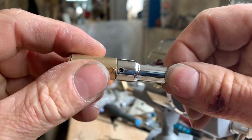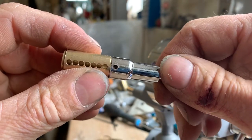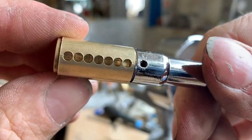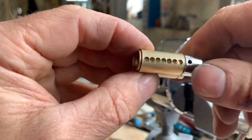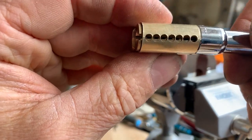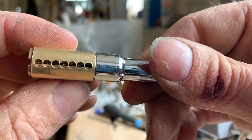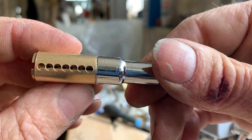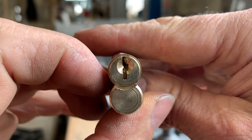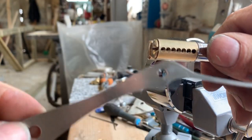This tail piece has got a roll pin in there, but when you take that out there's no circlip on the back of the core, and it just will not release. It has got the full six pins. Let's see if we can get a light in on that — it's drilled out for seven but it has got six pins in it. It's got an American Lock keyway on it.